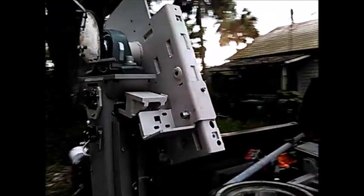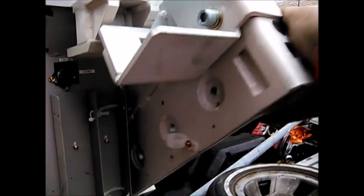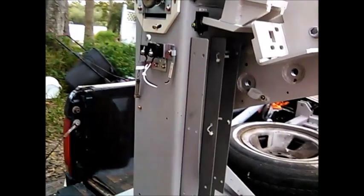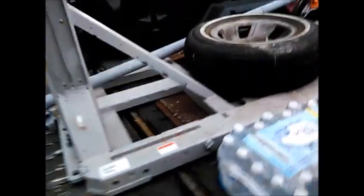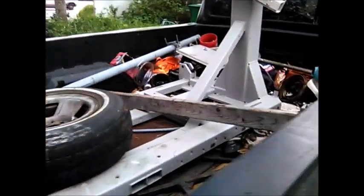I will strip it down to just a bare frame. It's got these big heavy things here on the inside with a nice saddle bearing. These things here, they weigh about 45, maybe 50 pounds. They're pretty heavy. I got to get up in there, take that nut off of there, and pull the shafts out. I'm going to save them for future use, maybe on a different ride. And right there on the bottom, you can see the piece of pipe that I'm going to use for an axle. I got a couple other different bearings.